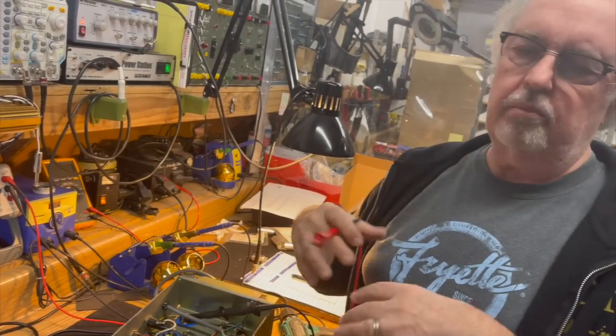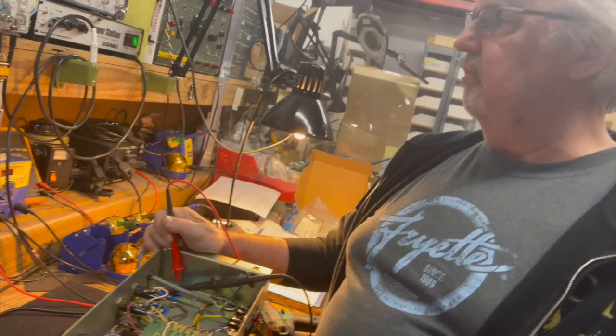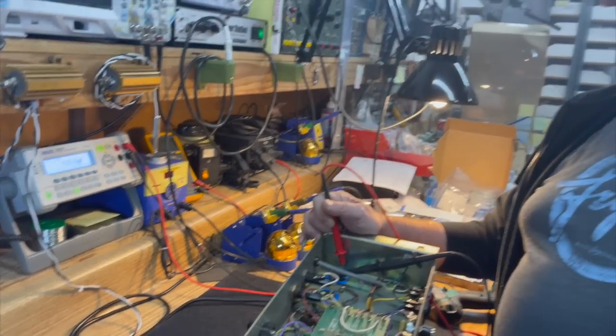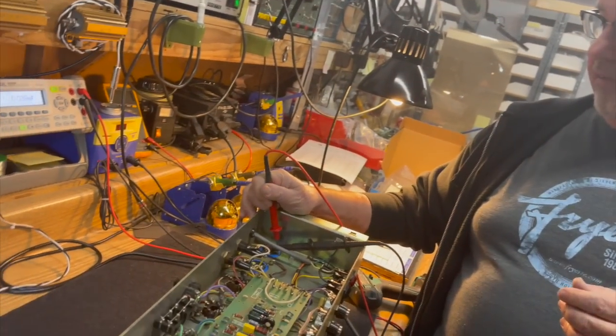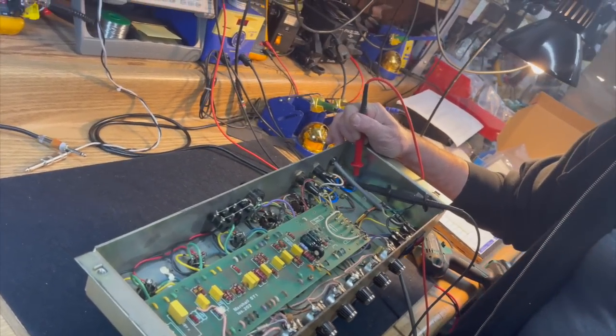Big capacitors like this, they're just really storage devices. So how much voltage difference in storage there is between 45 mics and 55 mics is insignificant. It doesn't matter. And that's why the tolerance is usually so wide on these. The good thing about these older capacitors that people just never even think about is the foil that's used as the storage medium inside the capacitors is generally thicker than the capacitors that are made these days. Capacitors that are made these days are more refined and more designed for a specific application, and there's a lot more to choose from, but the metallic substrate inside the capacitor, the foil, is generally thinner and generally doesn't last as long, but they're more accurate and they can have tighter tolerances and run at higher temperatures.